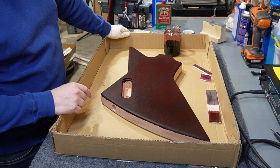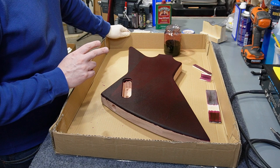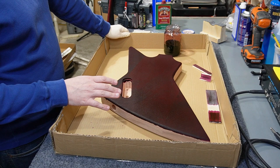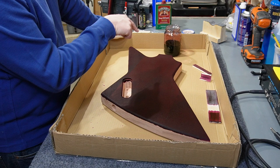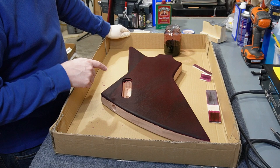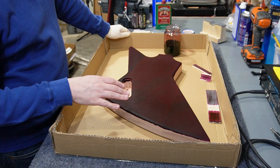The dye takes 24 hours to fully cure according to the bottle. One other thing I didn't show: prior to starting any finishing, I did a final sanding inside the cavity to get the fuzzies out of there. I also pre-fitted the neck just to make sure it fit right, and sanded a little bit in the neck pocket to clean it up. Everything's kind of final-sanded in those areas, but I didn't bother doing anything to the face, sides, or back - everything's rough just the way it came from the kit.